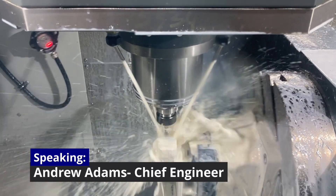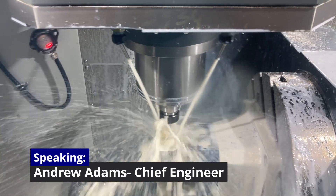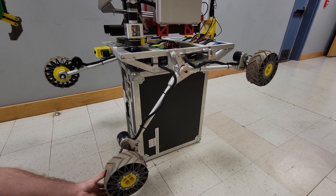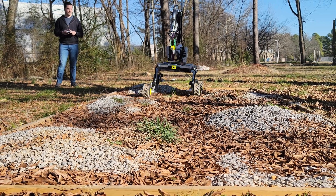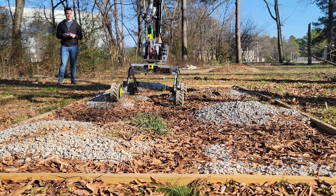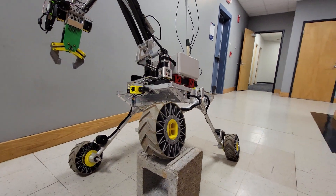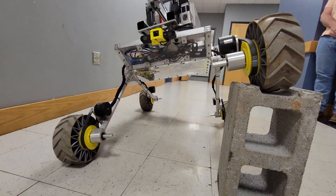The ability to manufacture custom parts in-house allowed us to create a lightweight rocker suspension with averaging stabilization that provides mobility for traversing difficult terrain. Unsprung suspension was identified as a prime candidate since it provides a stable and predictable platform for robot arm operations on uneven terrain.